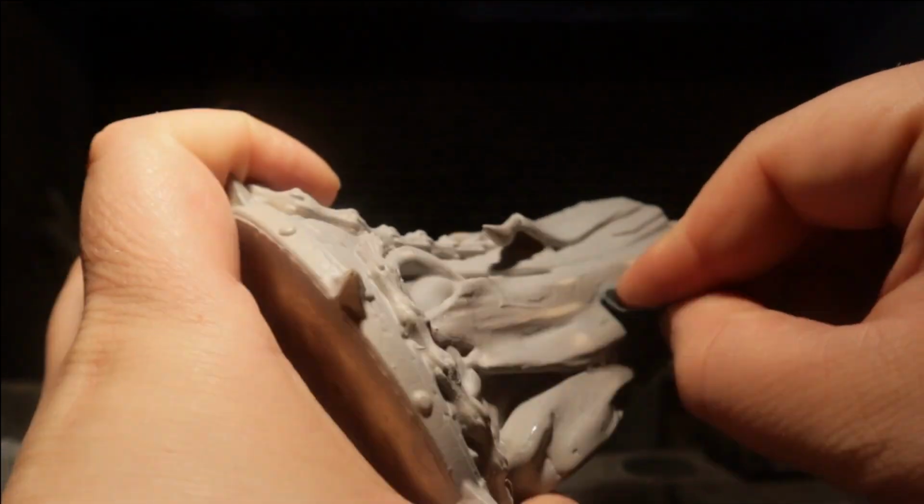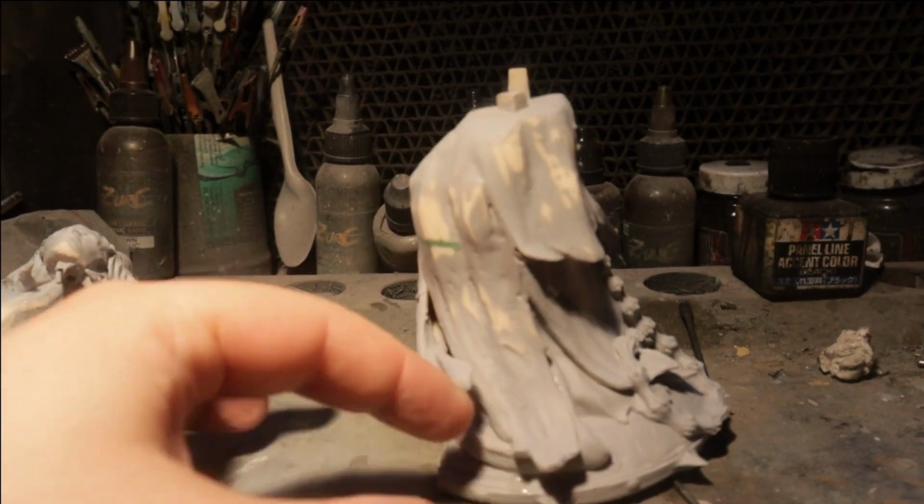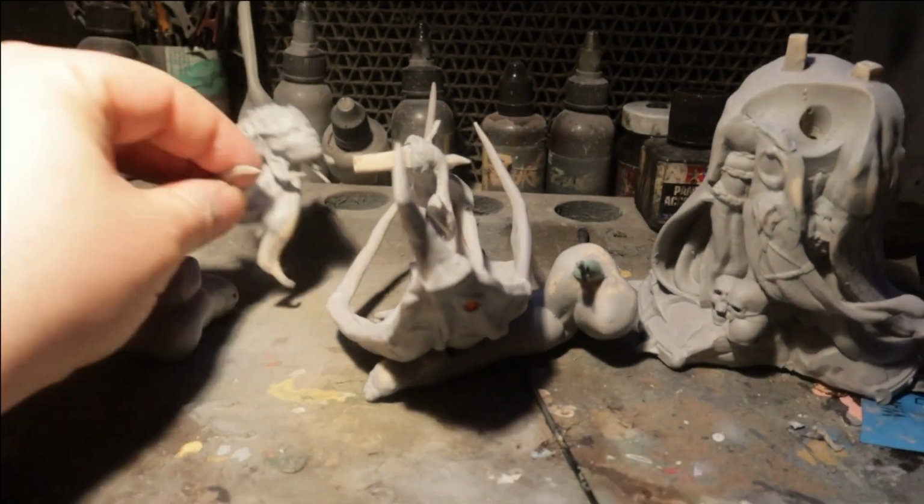There were a few from my sanding, so we went back to the Dremel to grind everything down properly and resand and polish those areas. The seam lines also had to be re-sanded. A second layer of primer was also applied to promote paint adhesion.